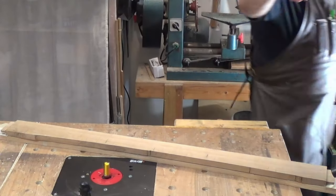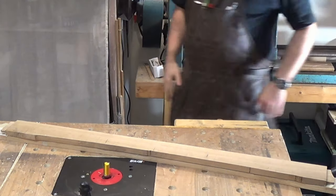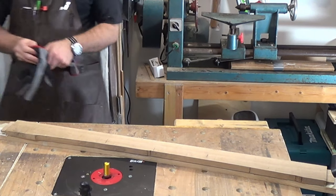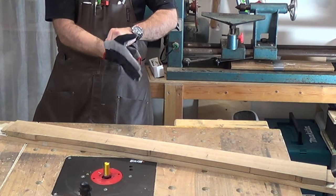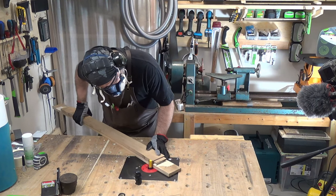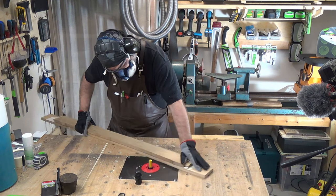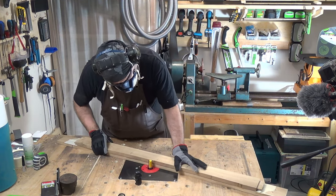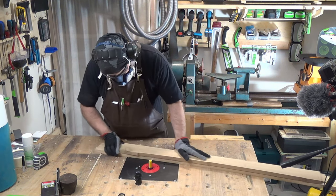This next piece had really crazy grain going in all directions, so here I had to get creative. I don't know if you can see it on the video, but I have marked here where I will start and stop each pass. I even did a practice cut. Again, I'm staying downhill or stroking the dog with the fur, so to speak, making climb cuts where the grain changes direction and change bits for the parts where the grain is going in the opposite direction. And again, all of this is to prevent tear out.